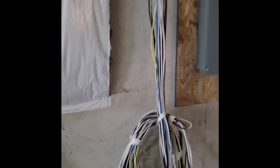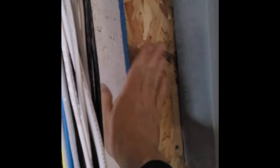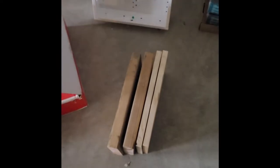This is the right way to do a nice house when you're doing low voltage. If I just mounted that panel to the wall as-is, the front of the panel would sit out too far. So what I'm going to do is build it out so it's the same level as this electric panel, mounting on the same surface. Then when they go to drywall it later, it fits flush just like the electric panels. I've made a couple of boards to attach here and then attach the smart house can to those boards, making the end of the smart house can even with the end of the electric box.